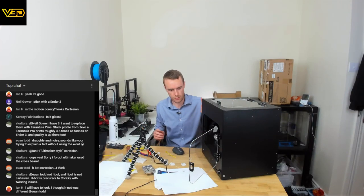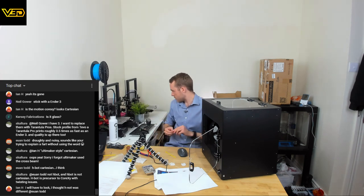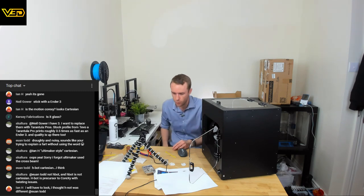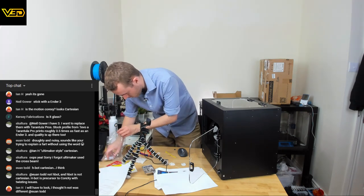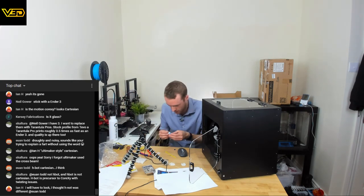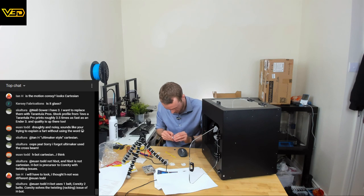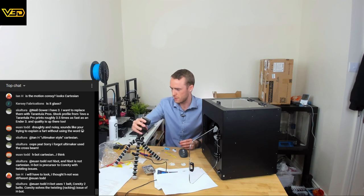Being that we can be pretty sure this is Marlin firmware, we need to check what's on this micro SD card, because we should have the Marlin firmware for the printer on here. We have a micro SD card reader, which is janky as hell. It's literally a PCB in a plastic case, and it comes apart like that. There you go, everyone. Oh, you missed it on the camera. Let me put it back together and I'll show you.